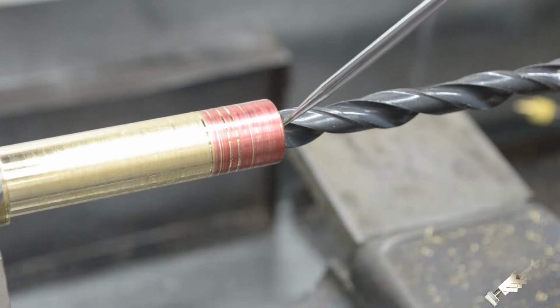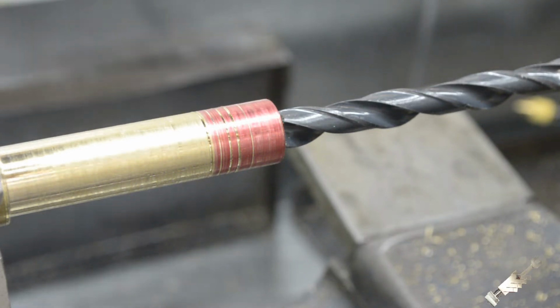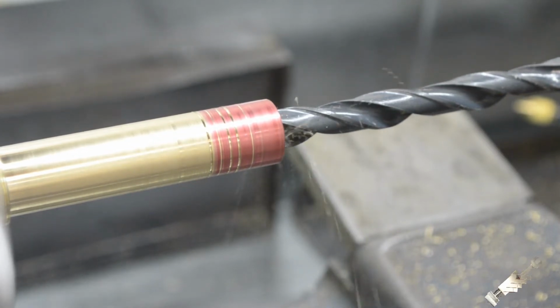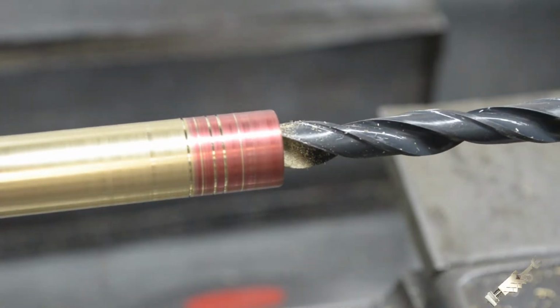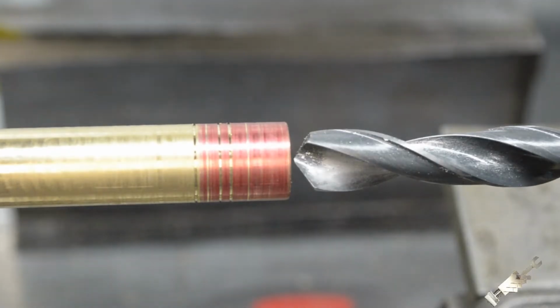And I got a drill, 3/8 of an inch for 17/32 deep. And then half inch, 3/16 of an inch deep. So, let's get started here. Now I'll come back with the half inch and go 3/16. All right, so now we've got a half inch drill bit and we'll go in 3/16.